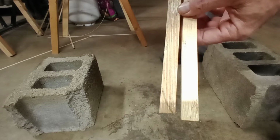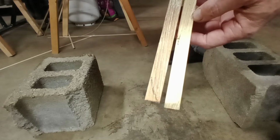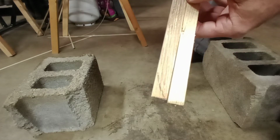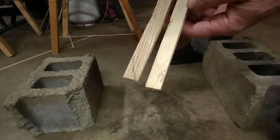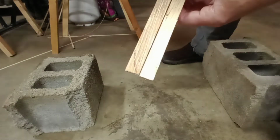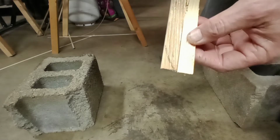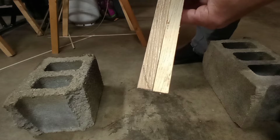And looks like a lot of wood. Yeah, the actual glue did not break. It was wood along the scarf joint, but it's significant wood fibers on both sides of it. So for the most part it was all wood breaking. So that was about as strong a joint as we've made using commercial white ash. And you know, as long as I'm using this super strong wood, why not try to get the glue joint just as strong?